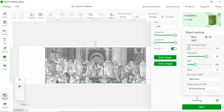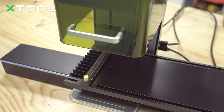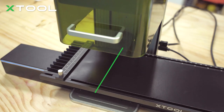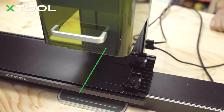Okay, and next we're gonna hit the framing. You probably asked me how to make sure where the engraving area is. When you start framing, the slide extension will automatically move until it finds its starting point — that is the starting line of your pattern. You can mark it at around 2.6. And next you want to rotate the button on the side to keep the extension moving until the blue square starts to shrink. You see it's shrinking — and that is the ending line at 13.2. So now you know how long your pattern is.